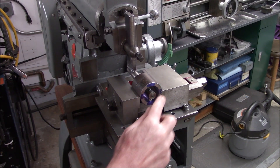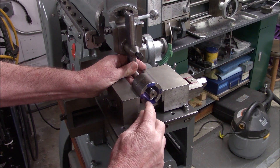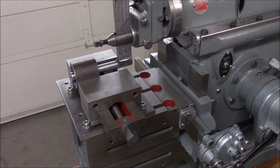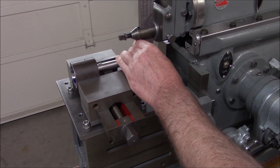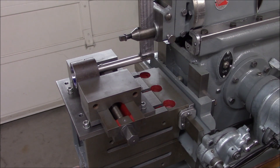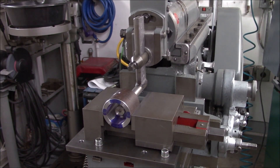I've got some layout lines here and I've lined up our X axis. What we're going to do when we start to take our cut - I'll get everything blued up - is look to see if we get a cut on both edges of our cutting tool. That way we know if we need to move right or left a little bit. Off-camera I already set up our stroke length. We're going past about a half an inch, and then on the backstroke about three-quarters of an inch, which will give the clapper box time to settle down. I'm going to try it with the clapper - I think a lot of guys do it with a clapper box lock, so I'm not sure what's the best method. We're just testing here, trying to learn how to run the machine.